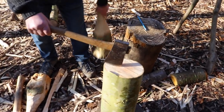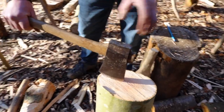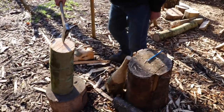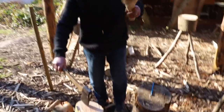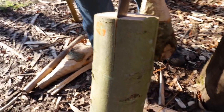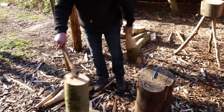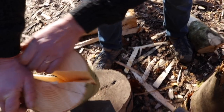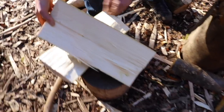I'm going to place the axe on the work, up to the pith but not across it. Notice I'm perpendicular to the axe — that means if it pops open, it flies out sideways and doesn't go straight into me. You don't want to be standing directly behind and splitting the wood. So we hold it there, lift the mallet and give it a whack. It's starting to split down — keep on whacking. And there we go, it opens up. You can see some lovely straight-grained ash.